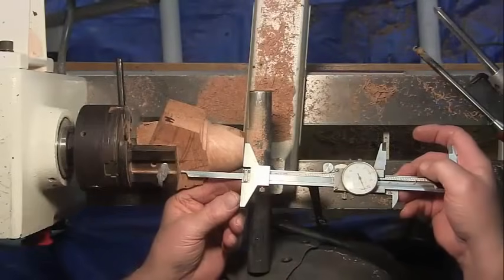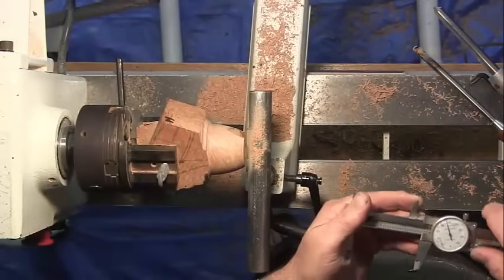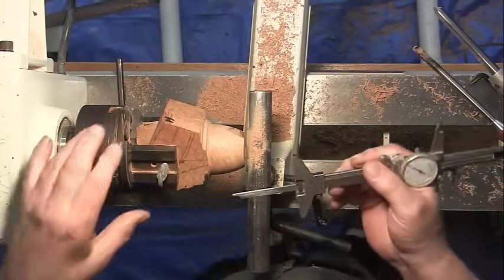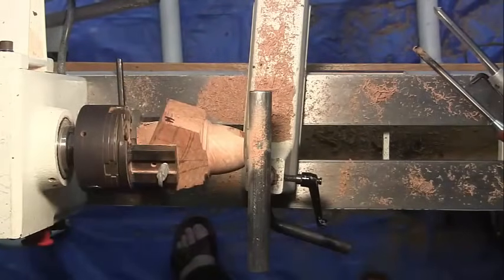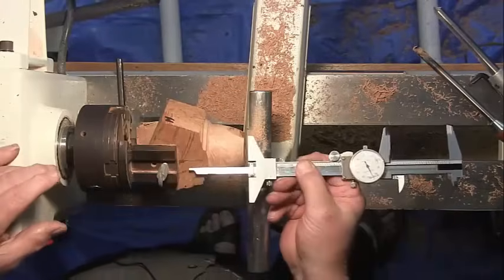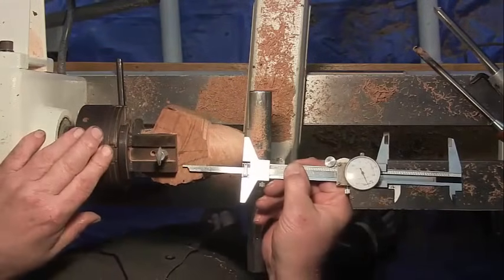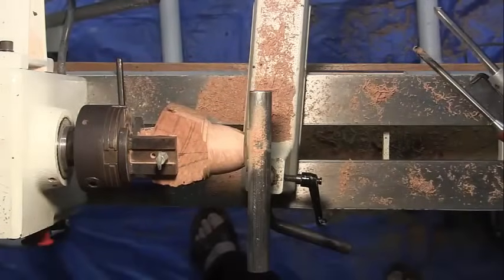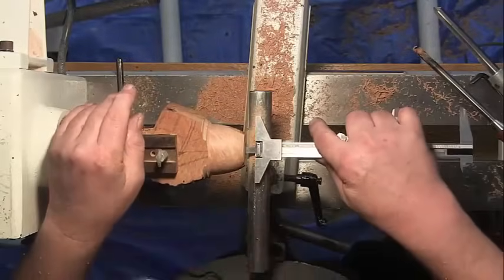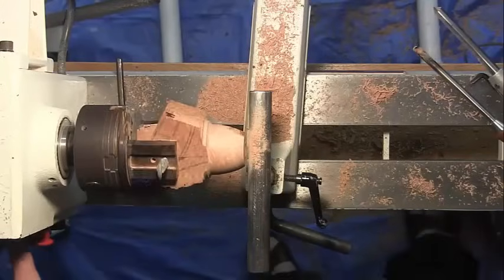The depth of my chamber here has a far end to it — you don't want to get too close to the tobacco chamber. If the walls are too thin it'll burn through or smoke hot. Normally I try to be pretty conservative. Here's the depth — I've got another five-eighths to three-quarters of an inch to go. The lathe never complains when you turn it on and off; if you're doing things that require close tolerances, it behooves you to check frequently.